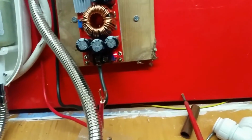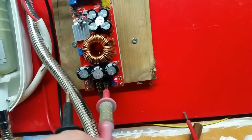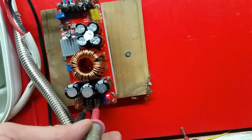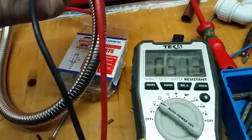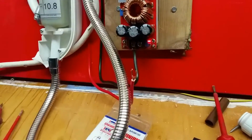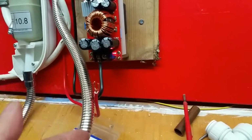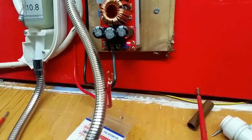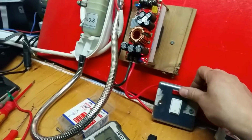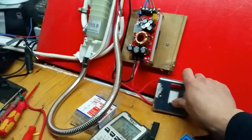So I managed to connect it up by just disconnecting the load side and connecting up the 24 volt live multimeter. We tested it out and we are at 51 volts. So we're verging on dangerous territory here. Now I'm just going to find something to operate a switch. I might have a double pole switch we can just pop on there quickly. Ready to go. Double pole 20 amp switch, meant for AC, second hand. In place. It should hold up for this test.